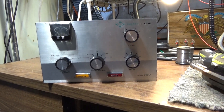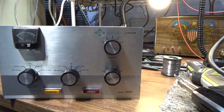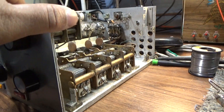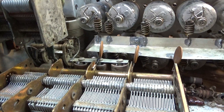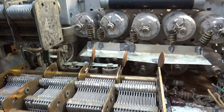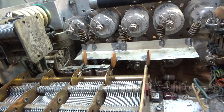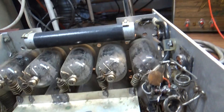It's a two-piece amp with the RF deck right there and the power supply right there. I'm already done with the power supply and it works, and I'm just about to start on the head here. Basically on this video I'm just going to go right quick through the output circuit, or what they call the tank circuit. Most sweep tube amplifiers use a PI circuit.